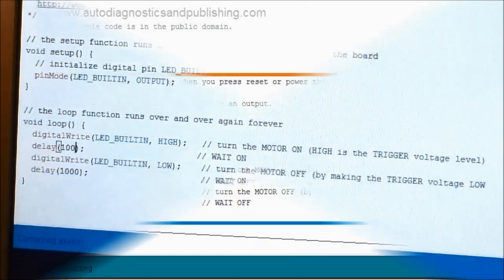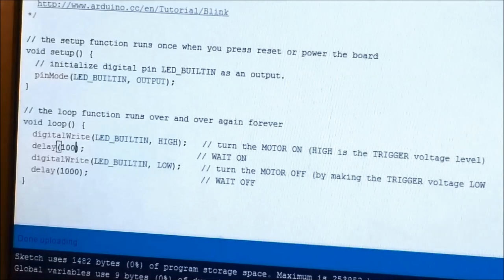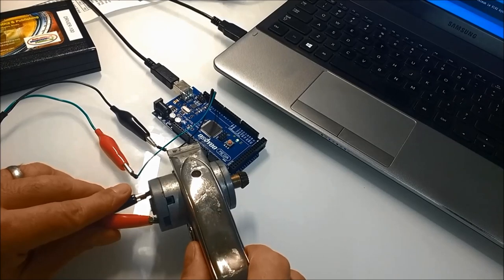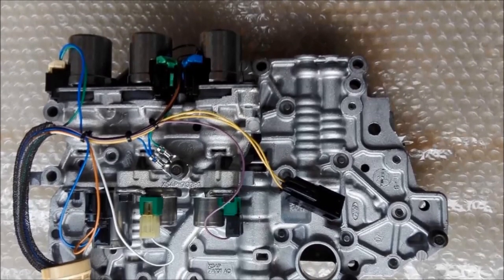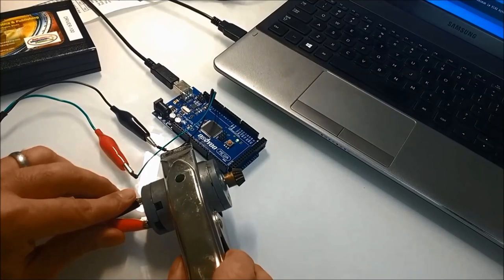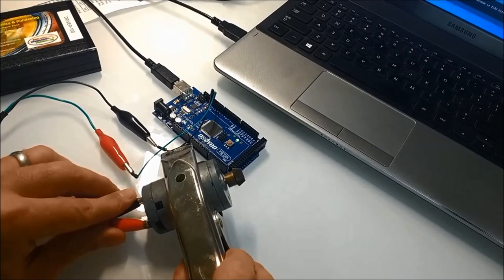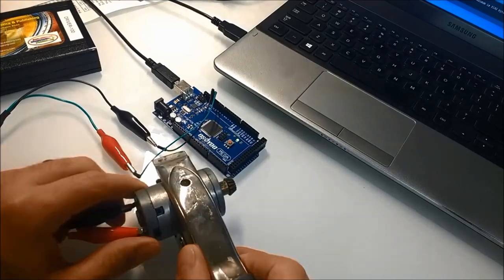Then next, we're going to tweak the delay. Those delay numbers that say 1,000, we're going to change to 100, and you're going to see how the motor turns on and off a lot faster than before. And this is exactly how, for example, shift solenoids come to mind, or it could be anything. Could be the fuel pump module, how it's turned on and off. In this particular case, it's duty cycles, which is an on and off pulse, and that's how it's actually done. Depending on the reaction of this particular module, the Arduino,